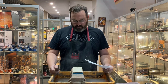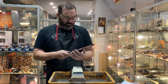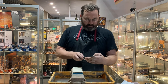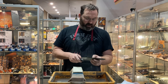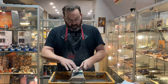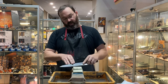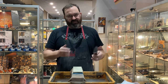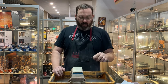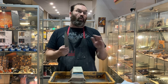So newbies out there, guys getting their sharpening on stones — why aren't you getting the edges that you think you should be getting? A few things. He asked me to look at this knife in particular. It's a blue steel stainless clad Tsunahisa, 240 millimeter. I can tell his problem was he's probably going too high of an angle — too high but inconsistent. Starting at one angle, but naturally when you come out, you want to roll your edge out like this, then coming back you bring it up like a sweep. It's a natural motion, but you have to not do that. Because once you roll up that highest edge, that's going to be your new edge unless you grind it all down at a lower angle.